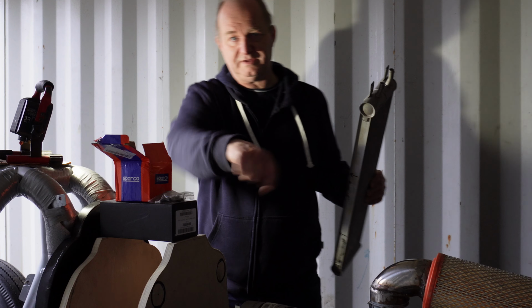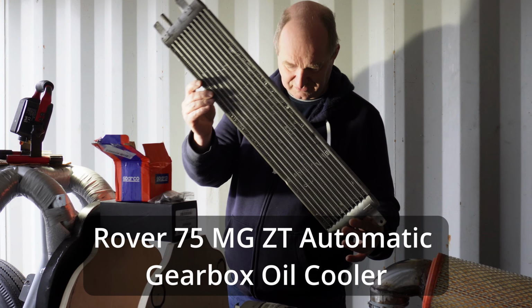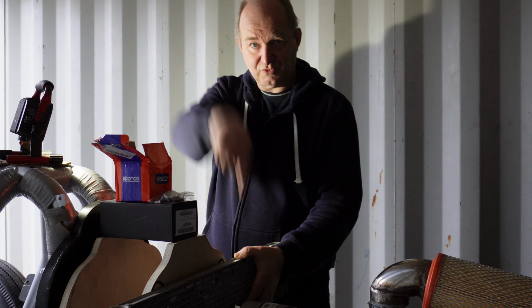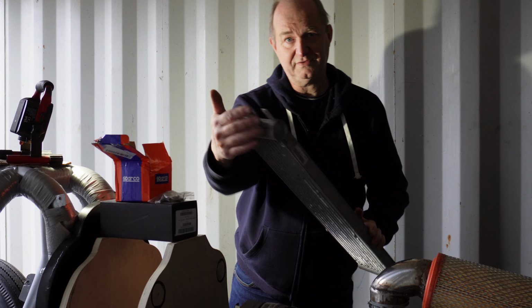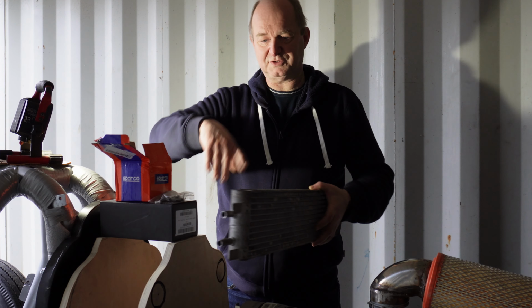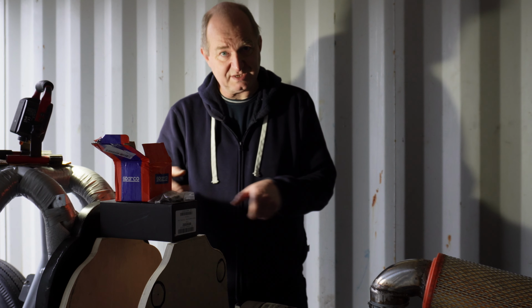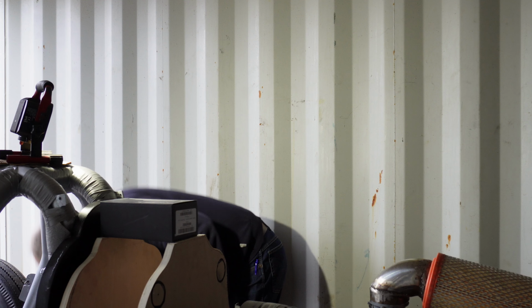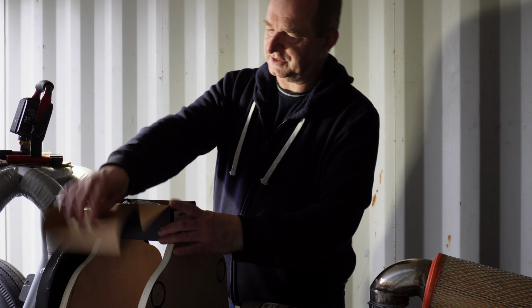In terms of this water tank, the plan is this is from a Rover 75. It's an oil cooler from some sporting version of the Rover 75, because it's not made anymore and it was never a particularly popular model. These are quite cheap, so that will go here, right down in the bottom under the engine, and it'll have electric fans on it, and it's got 2 ports here, so when the car's parked, water will circulate through this with an electric pump, which I'll show you. And the warm air will then vent out underneath the car, through the vent that the exhausts also fire into. The idea was that would form a kind of Venturi system, although I don't know if that actually works or not. But anyway, it's a convenient way of cooling the water in the water tank down while the car's parked between runs, because you're probably going to look at a couple of hours between runs.